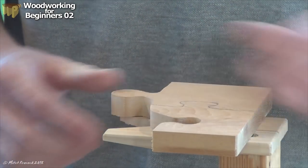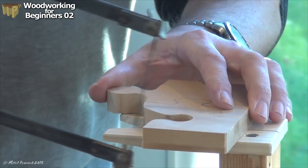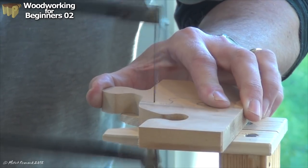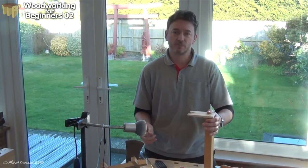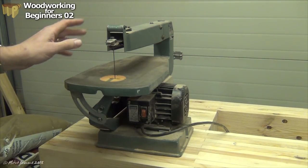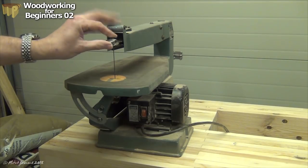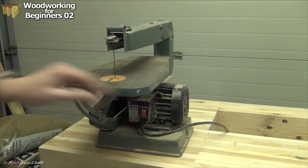It's time for me to finish cutting this piece out. I love cutting these out by hand with the fret saw. But if you prefer a power tool for it, then you need a scroll saw. A scroll saw is basically a machine that moves a fret saw style blade between a couple of arms that move up and down, and you use the table as the work support.